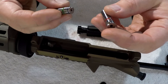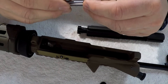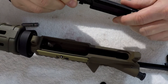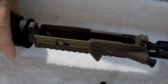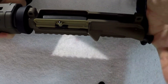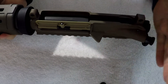I've got a no-go and a go. I've also taken a Dremel and machined out this area here so that you can put it all together and run it how it's supposed to be, and check to see if it's going to work or not. First thing we're going to do is the no-go. Because that part's Dremeled out, it just inserts. And just try to run it. You can see that it won't go.